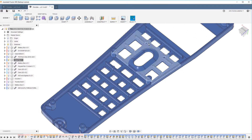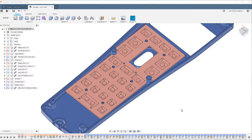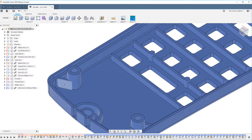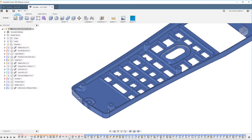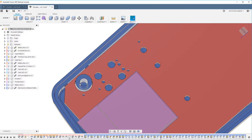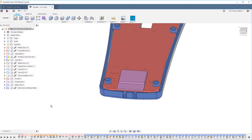I've also been adding various other things. These are pins that hold the keypad in place. If I show the keypad, you can see there are holes in the keypad itself, so these little pins make sure the keypad is held in the correct location and doesn't move side to side. I've also been putting some little bosses or ribs next to the bosses that hold the screws. These ribs help fill the boss because plastic can come in through the sides as well as the bottom, and they also make the bosses more rigid. We also did a revision on the circuit board — before, the boss was on the bottom of the side of the circuit board, which didn't give much depth for the screws. So we redesigned the circuit board to allow the boss itself to go through the circuit board, allowing much more depth for the screws and making it a much more secure enclosure.